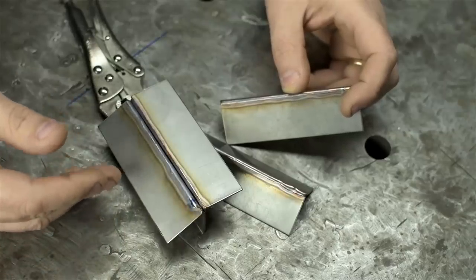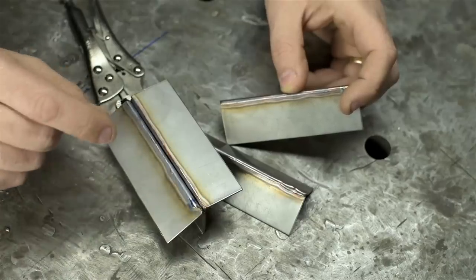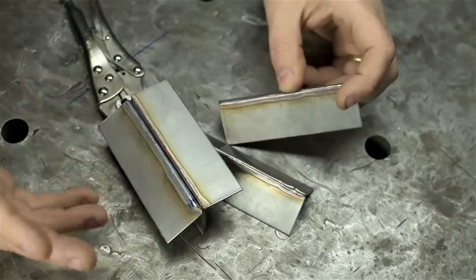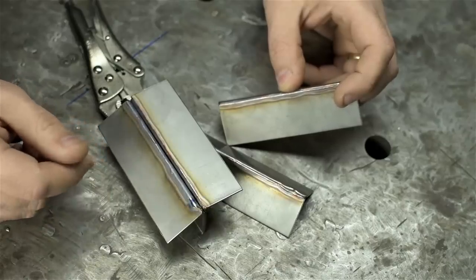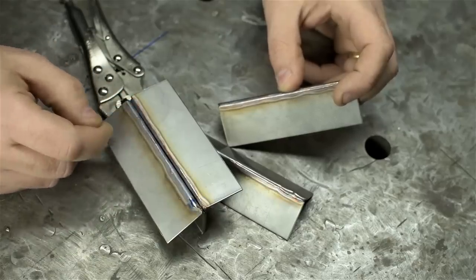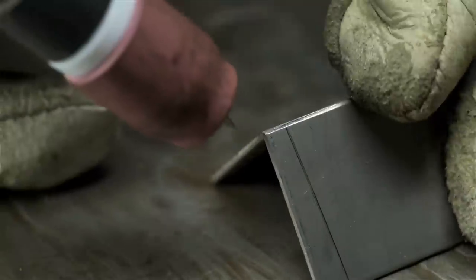To anyone who's actually tried pulse welding, it becomes very apparent very quickly that it's not as much heat input as straight welding. To get your pulse welding to weld at all, you may find yourself bumping up the pulsed amperage to get enough heat on the peak of that pulse to properly fuse or create that little weld nugget. In other words, you'll turn on pulse welding, set it to what you think might work — say 100 amps — start a weld, and discover that isn't enough, then sneak it up to 110 or 120. Or flip side, you may increase the pulse on time. When you get that balancing act right, one shot of the pulse train will melt a nice little weld bead — just like tacking the ends up. That is effectively just one pulse: hot enough to melt and tack the material, but not hot enough to blow a hole right through it. Just a lot of those pulses one after the other.